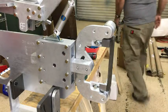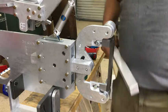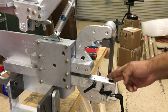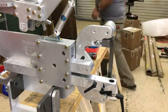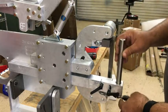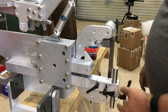The reason that we use those spacers is because we need a little bit of a gap when you've got your work rest in here. If we didn't have those thin little washers, this would rub on this and you wouldn't be able to slide your work rest in and out and get everything dialed in the way that you need to. Those little washers keep it out of the way - that's the reason you do it.